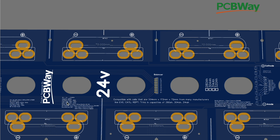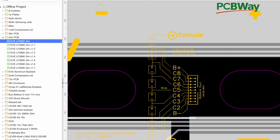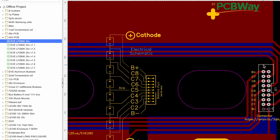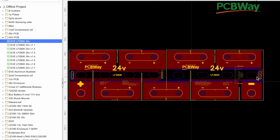I added text to help you get the right connectors depending on how you build this. Another important addition was these trace fuses. In earlier versions the traces just ran straight through. The problem is if you connect this battery to another one in parallel and the voltage difference is too large, it puts a lot of strain on the traces — they could melt and burn up, potentially hurting someone or causing a short. You want those traces to burn cleanly when you make a mistake, whether you short something out or connect wires backwards — that happens with inexperienced builders and even experienced ones being careless.